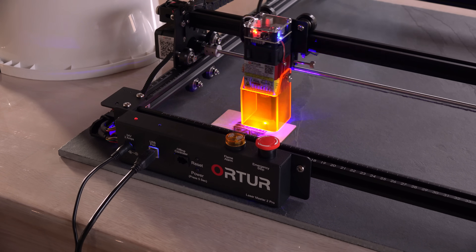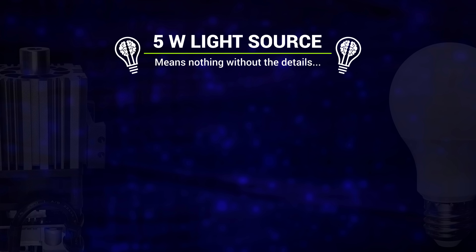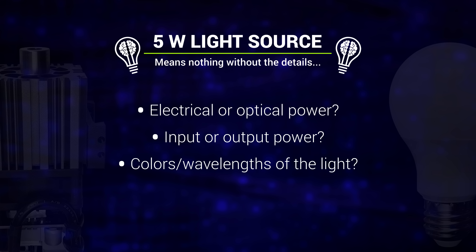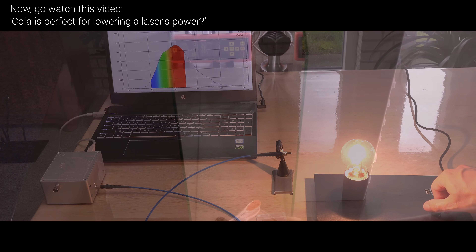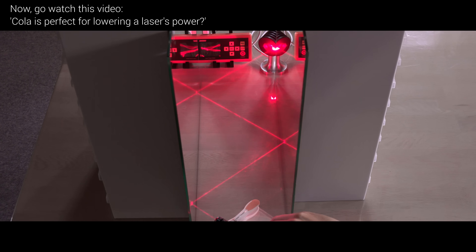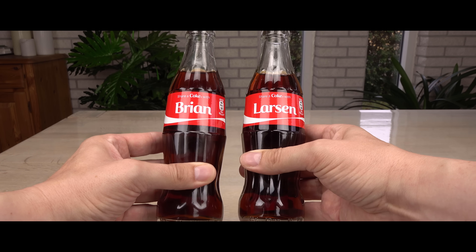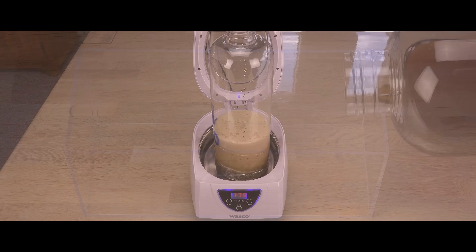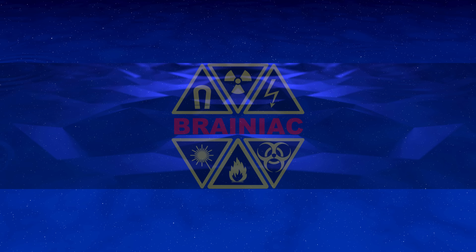If you want to engrave or even cut stuff, you can use a strong laser engraver — more info on this model in the link in the description. We now know that a 5-watt light source is a very broad term. It is important to know if the wattage is for electrical or optical power, input or output, the colors of the light, and especially the power density. These details make a crazy difference. Click like if you enjoyed the video. And if you want to send me something, I've changed my P.O. Box address — the Danish Postal Service decided the facility I was using could no longer handle packages. You can always find my latest address and email by clicking on my channel name and going to the About tab. Thanks for watching. Bye for now.